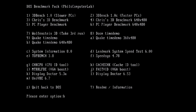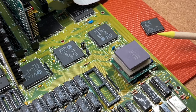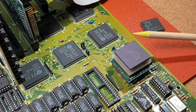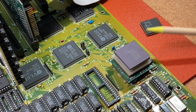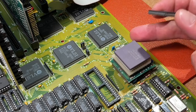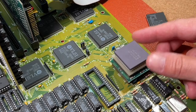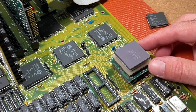The cache check tool also cannot be started because it requires a 386 CPU. Unfortunately, the cache is not working at all. There were surely special drivers or software needed to activate it — without that, it does the same job as the plain AMD 286. It just looks much cooler, but that's it. If you have any hints on how to activate the cache or which software might work here, please write a comment below.